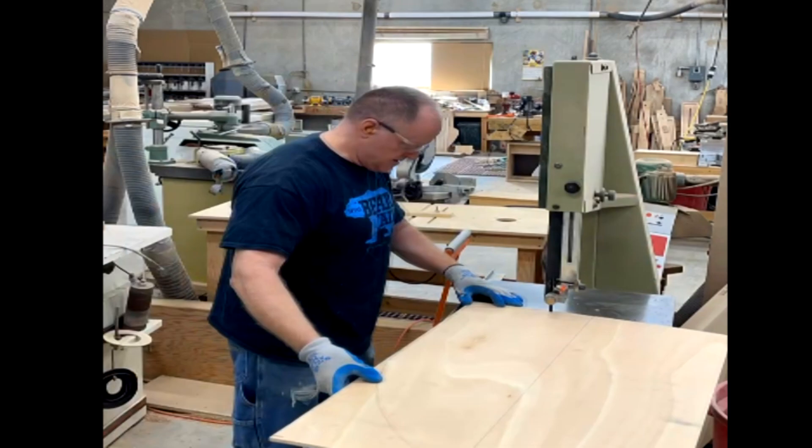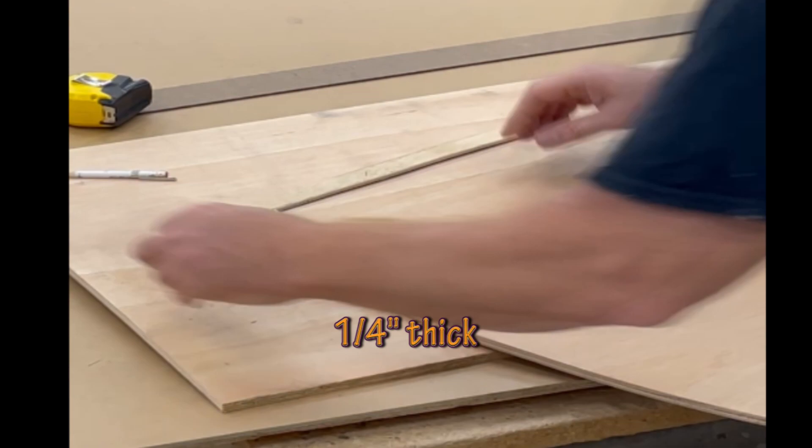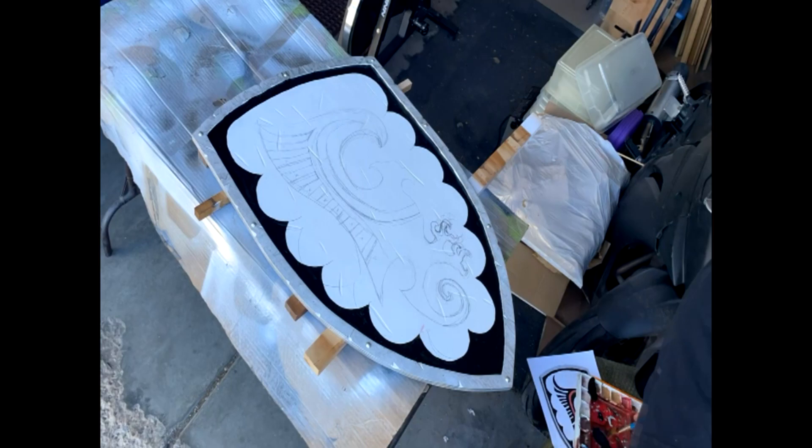I took some half-inch plywood and traced and cut out the main body of the shield on the bandsaw. I then traced and cut out a one-inch wide edge trim and glued and nailed that on. I often use scraps for this, but just make sure you putty the seams. Then I used some old upholstery tacks and hammered them along the trim. Then I quickly spray-painted the trim with silver metallic, brushed on the main base coat, traced the border with a bucket, and after penciling in the main image, I got to it.